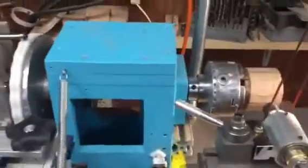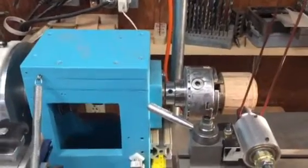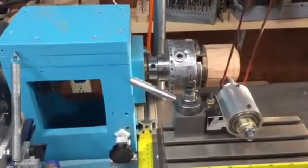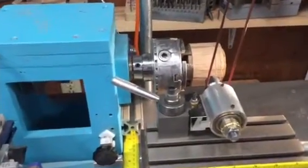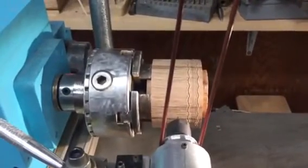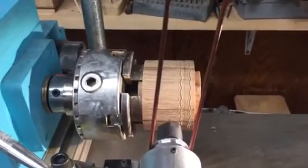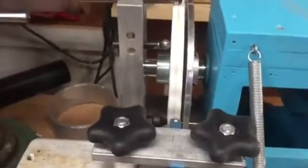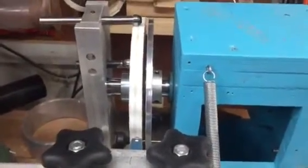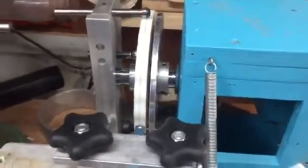I'll go ahead and flip on the machine here in just a minute so you can see the pumping in action, and then we'll fire up the cutter and actually take a small simple cut so you can kind of see what happens. You can see basically the pattern that just this simple cut will make. Now I'm not doing any rocking today — I've got the headstock locked in place so there's no rocking action in conjunction with the pumping action. We're just doing a simple pumping action with the Rose engine so we can get an idea of how that works.